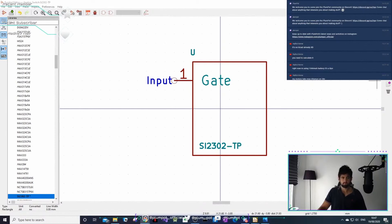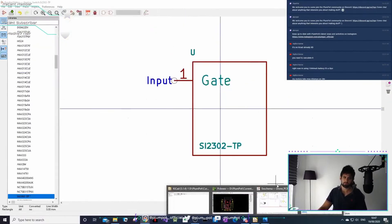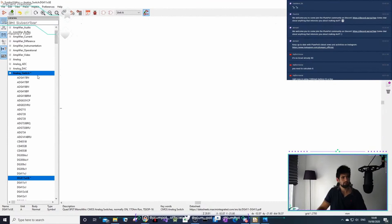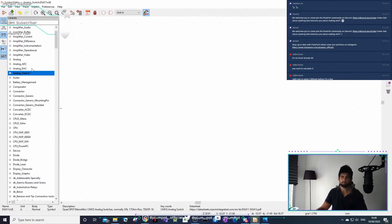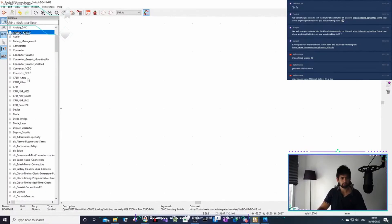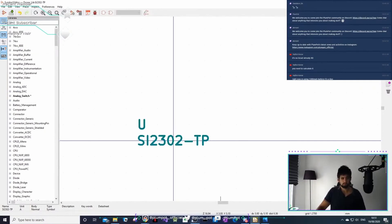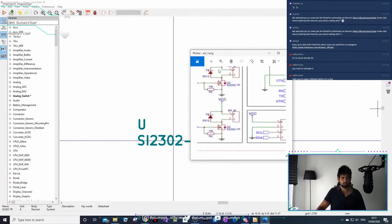I was thinking about sharing this after it's final, because there are some changes we need to make - it's only in the schematic now. I must be careful because where I choose here is where I'm going to save this library. So let's just make a new library called drone. What I want to achieve is I know how to make the boxes, but I want the same symbol format as for each of these components.